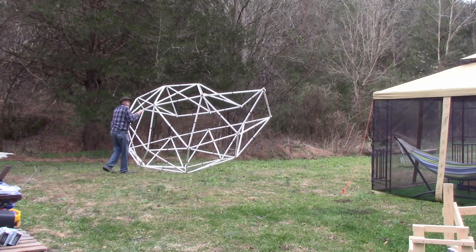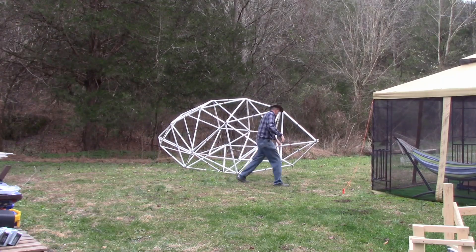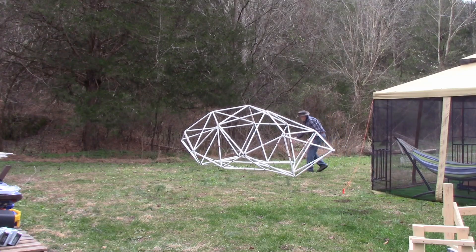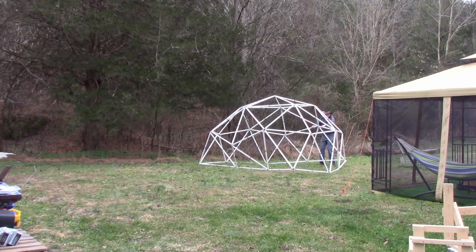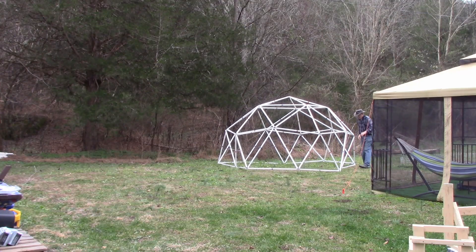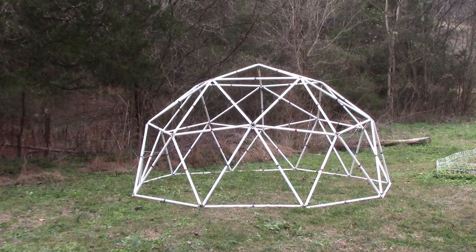This problem is not just with domes connected only with center rings and zip ties, but it is a problem for any dome made with connectors that do not limit how far the struts can move. There are quite a few dome connectors that work just like this one that do not control the strut angles and produce a very weak dome structure. These domes with simple hubs may look good, but the hubs do not control the struts, and even if you straighten the struts to correct the problems with the hubs, you still can't do a chin-up on the dome.